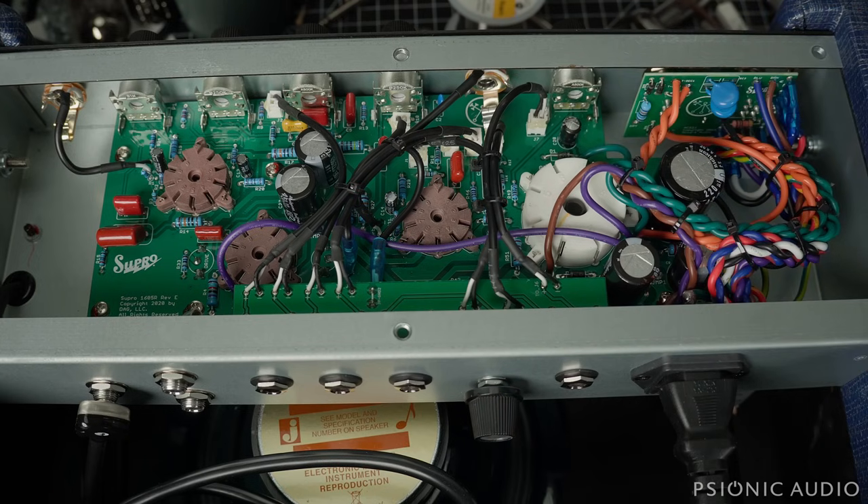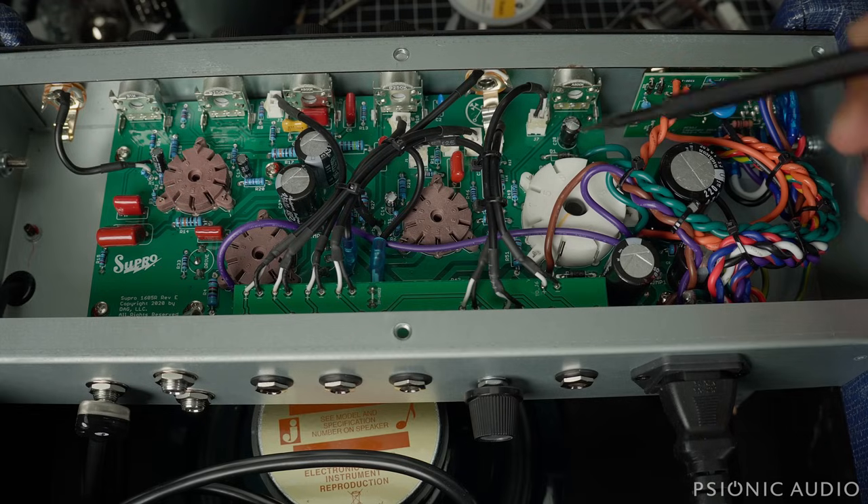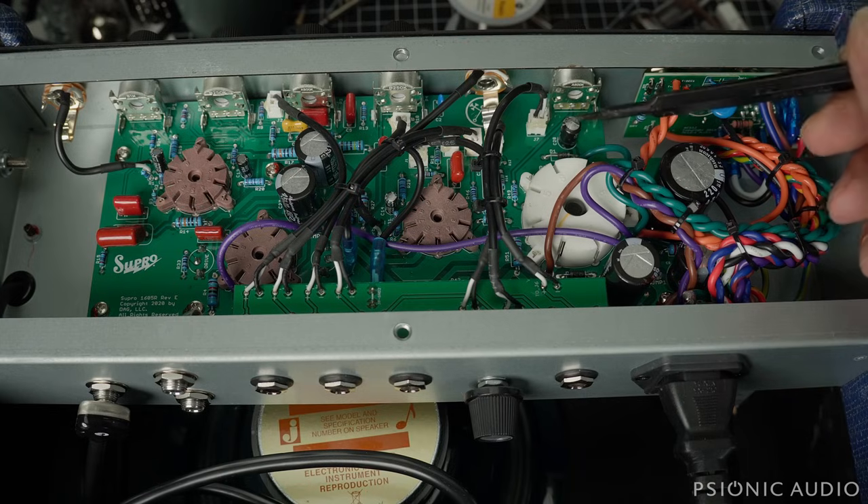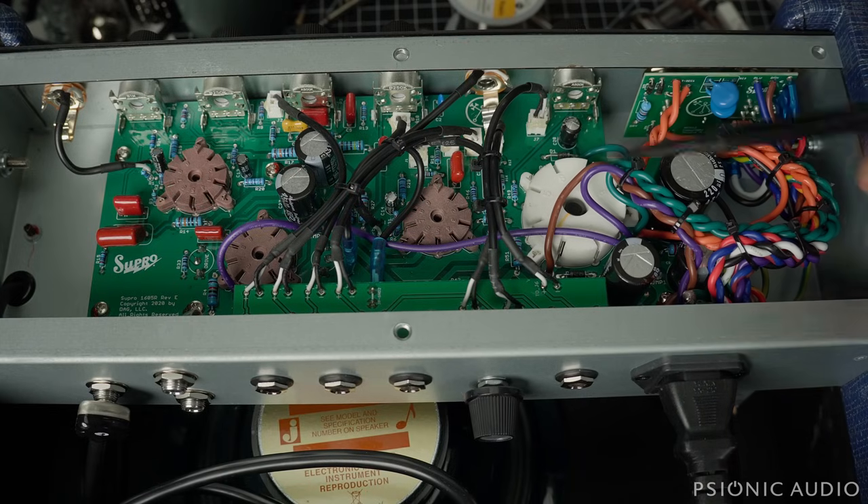But when the crucial jacks for the speaker and input are not reliable connections, and when you have caps that blow up when an amp is left on for a day or two — should you leave an amp on for a couple of days? No, mainly because of the utility bill, but the amp should survive it just fine. I typically leave big amps I've restored on for 12 to 24 hours as a burn-in test before they go back out. Just leaving a brand new amp powered on for a day or two should not be a torture test.